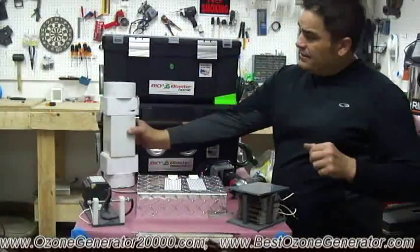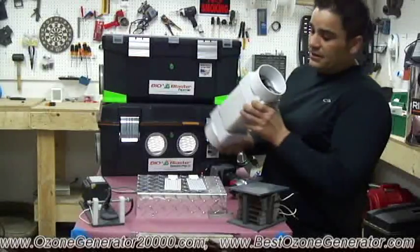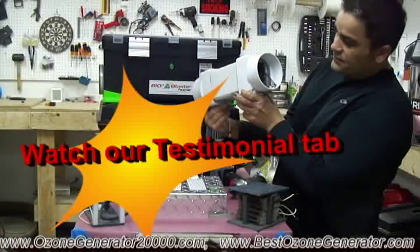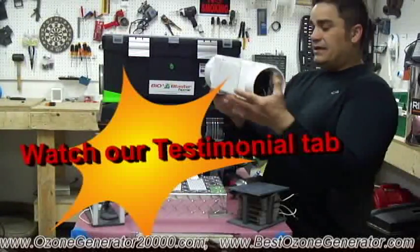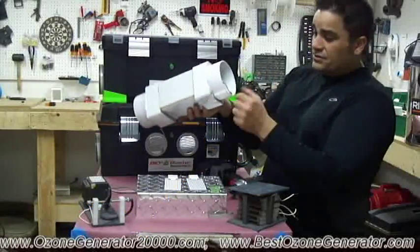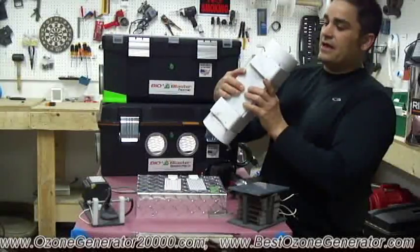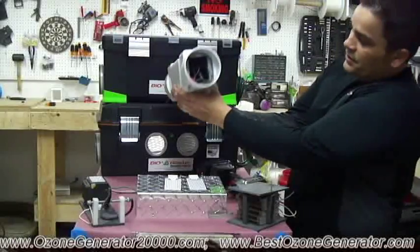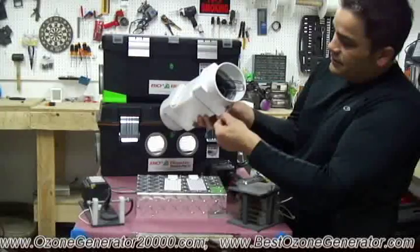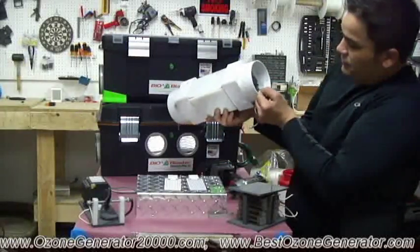And this is again one of our first ozone tunnels that used the mica technology. And while this generator cell never suffered a burn through because of the way we soldered the wires, and it is a super durable, heavy duty tunnel that segregates the ozone from the rest of the machine, what you'll see if you look in the end is just a massive amount of that carbon ghosting. Matter of fact, these are white wires. I know they look black, but these are white silicone wires that have become coated with carbon.